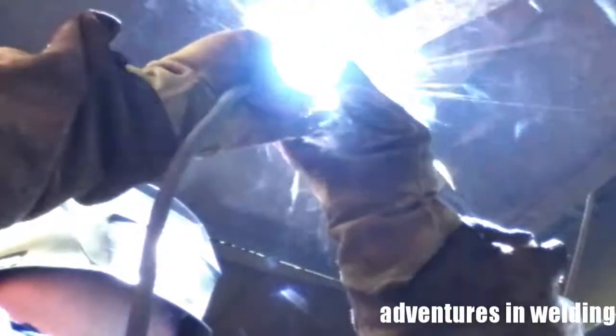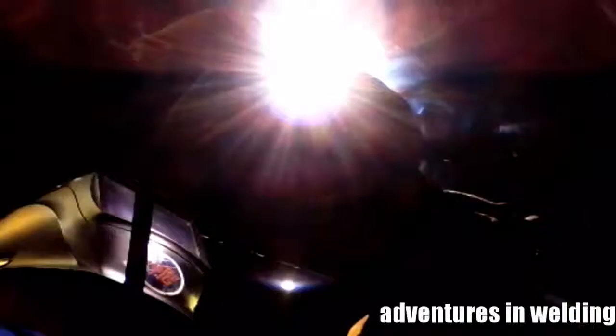We're ready to strike the arc. I'm standing parallel with the axis of the weld because you want to be able to see what's going on in the puddle. Very slight weave movement back and forth, eyes locked in that puddle watching everything that's going on. It's not a lot more difficult than doing it in the flat position — it can just be a little bit more uncomfortable because you're reaching over your head.